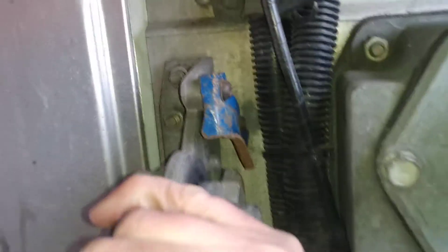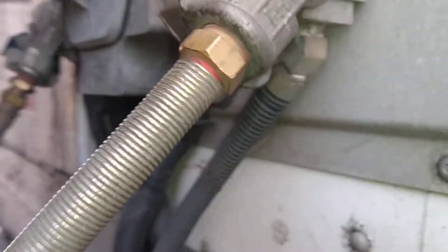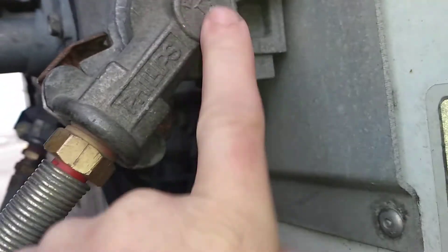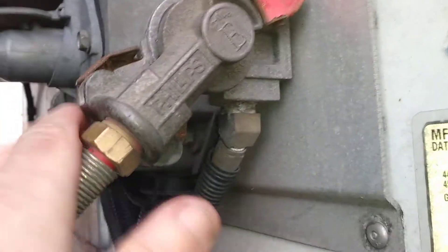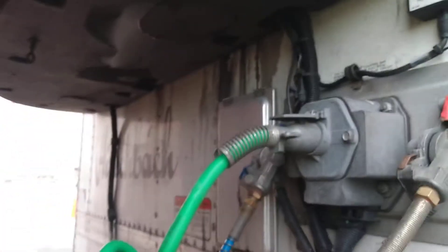It's supposed to fit like this. See, when you take this right here and you put this in, it's supposed to fit — you'll notice the gap in there, but there's nothing holding it. You see it fits flush, and it's easy to go in. This one here you shouldn't have to take a hammer and hit. So if you ever see one of these squares on the red airline — emergency airline — it's wrong, because you're gonna have difficulty getting that on. Anyway, I was just showing you this here is a Hirschbach trailer too, but I'm just trying to get this trailer out of here.